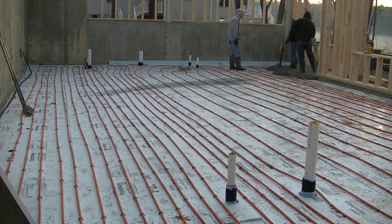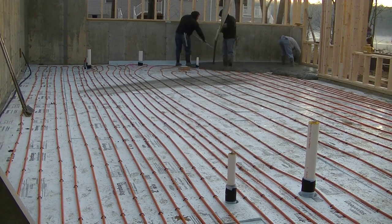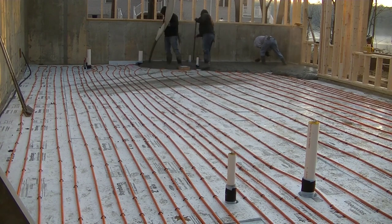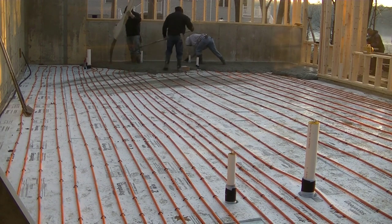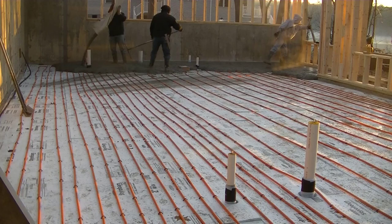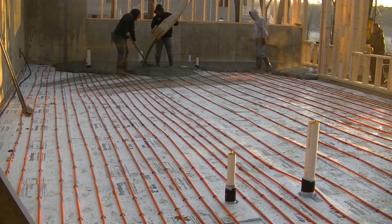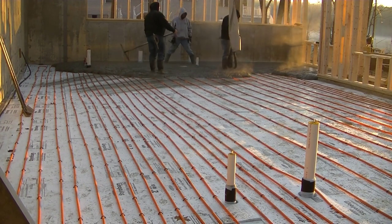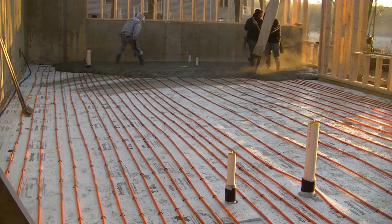Pouring on Styrofoam is also a big deal when it comes to getting your concrete to set up. If you're pouring a concrete floor in cold weather and the sub-base is really cold, that's just going to suck any heat right out of the concrete and really slow down your set time. Pouring on an almost frozen sub-base without this Styrofoam, our set times would be hours more. So that's a big bonus for us.